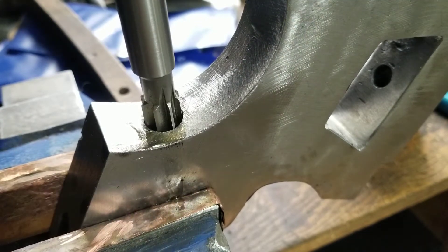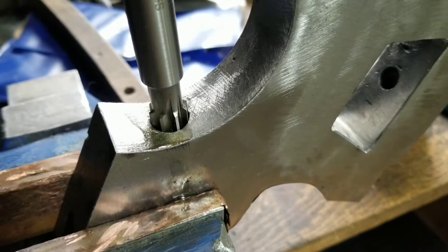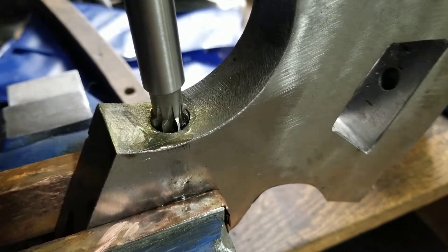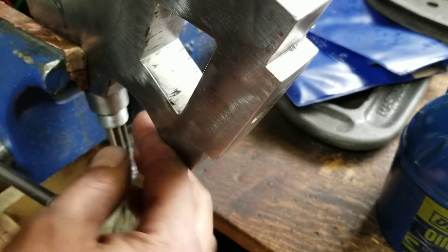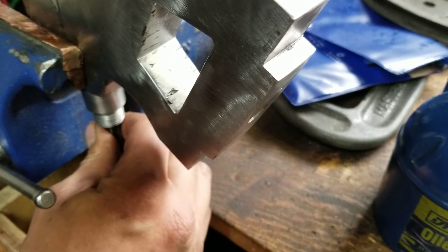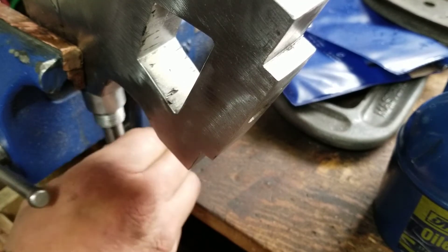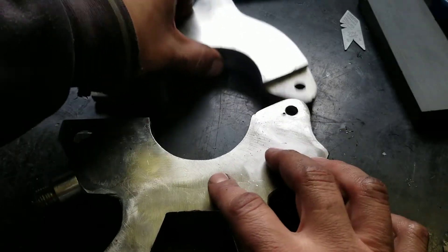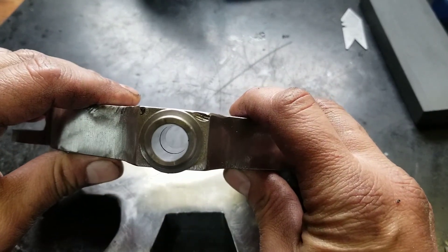This is not like a tap — you've got to turn them in a clockwise direction only, otherwise you'll be destroying your reamer. And they're pretty expensive, they ain't freaking cheap. So far so good. Holes are all reamed and looking pretty schnazzy, nice and straight. Starting to look like something now.